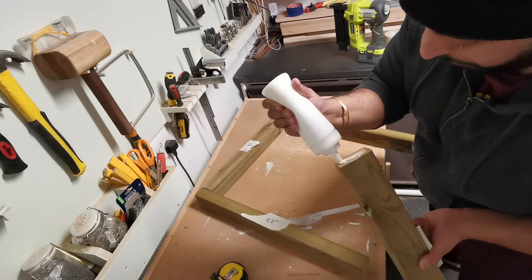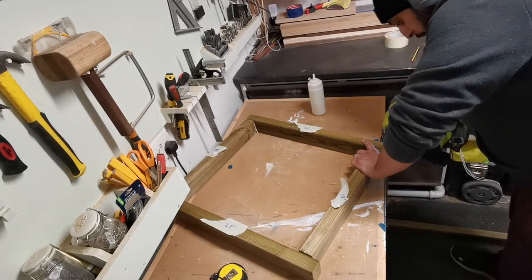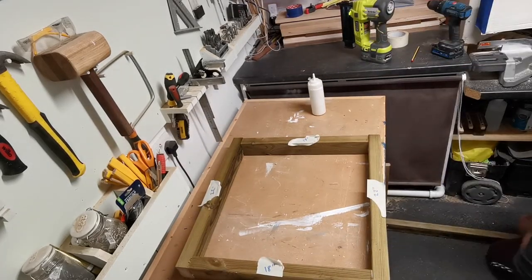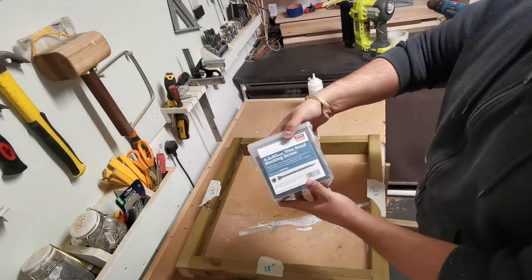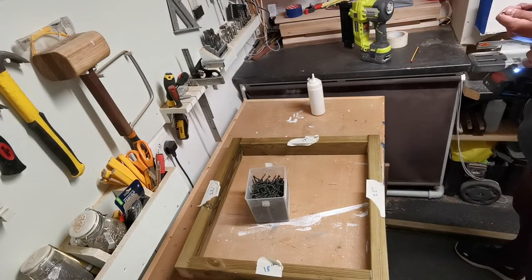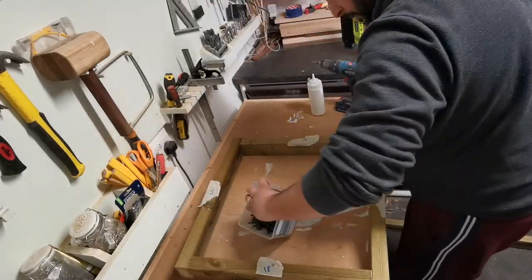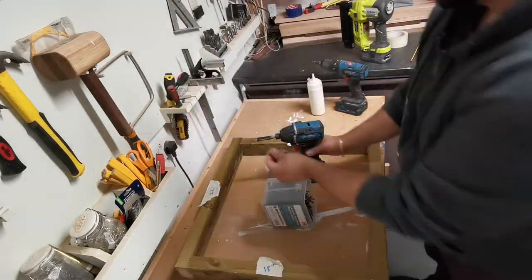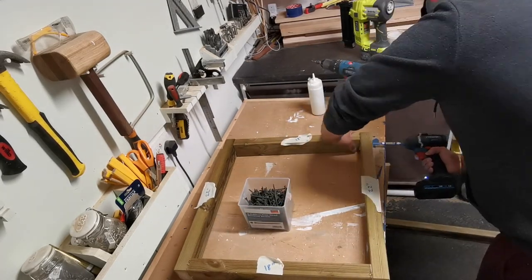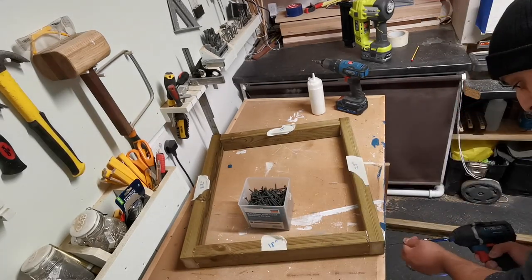You don't need to use a nail gun here. I chose to use a nail gun just to hold everything in place before I decided to then screw all the pieces together. I use lots of glue and long enough screws to get them nice and tight, and the screws I'm using are decking screws — because they are suitable for outdoors and the head of the screw is very small so they kind of sink in and it's not very visible. The decking screws have a square shaped bit which came with a pack, but you could use any screw really, this is just what I had available.